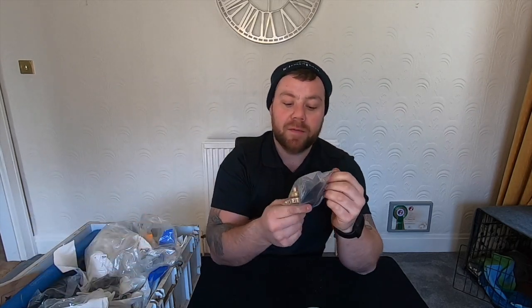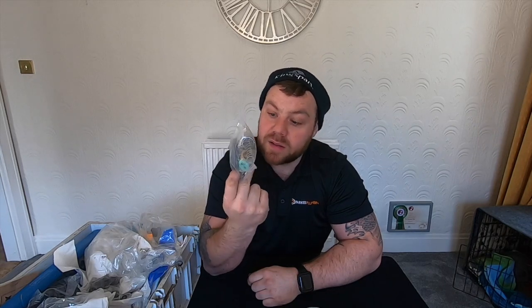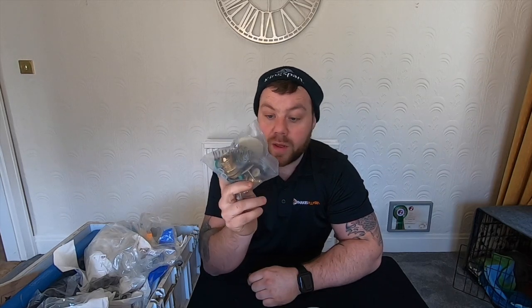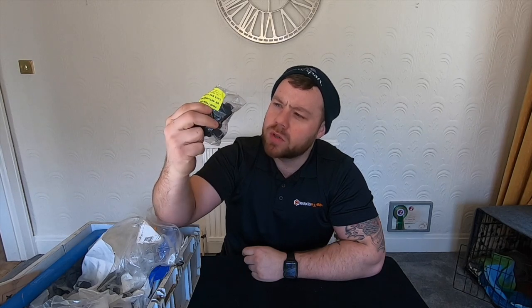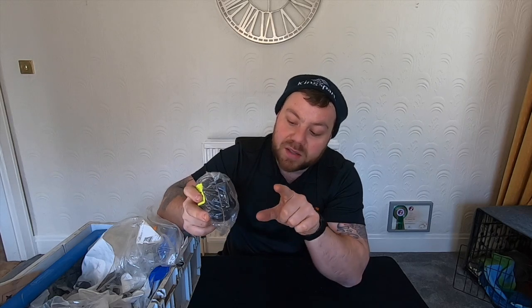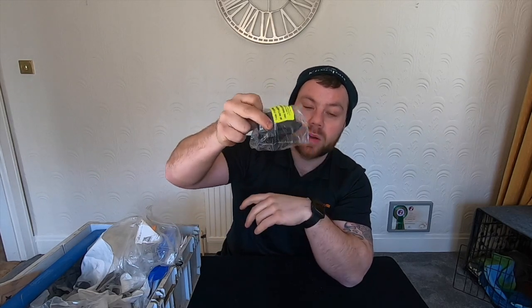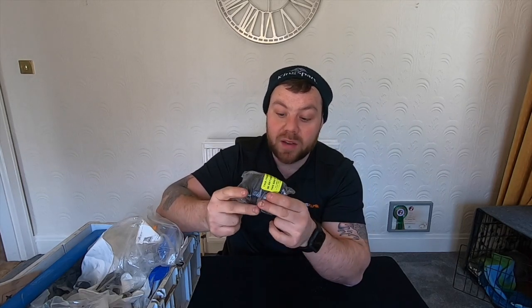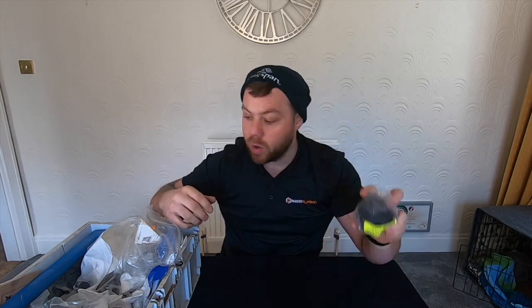Baxi 105 diverter kit — Tim does one down at All About Gas. Always handy to have. Diverter motor — Vokera linear, Ideal Logic earlier ones, some Baxis. Always good to have on the van. What happens is the diverter leaks, the water is soaked up into the motor, it blows the motor. Sometimes it can trip the electric in the house too. So if they're saying the power's tripping out to the whole house, have one of these on the van — you won't go wrong.